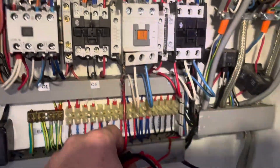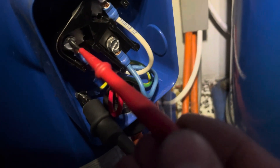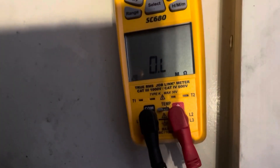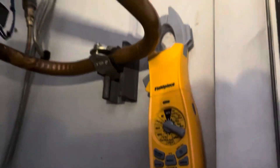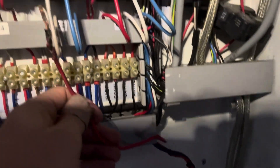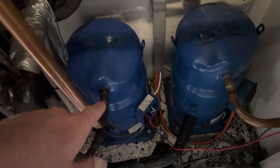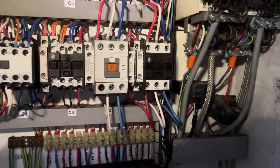We'll test our compressor to see if it's okay. At minimum, that needs to be replaced. So we're going to test our windings to earth. It's a bit cramped here with a wall right there. Winding one — pretty good. Winding two — that's good. Winding three. I'm just going to test winding one again because that was the one with the burnt wire. Yeah, cool — it seems like it could have just been a loose connection. I basically just pulled it and it dropped. It could be a loose connection, but regardless we're going to need to replace that. I'm going to IR test the compressor as well just to really confirm. From the looks of it, the compressor is okay — we'll just need to come back and replace the contactor.